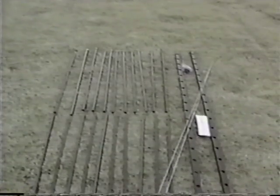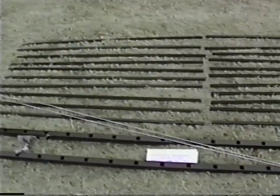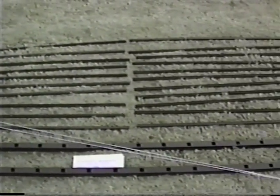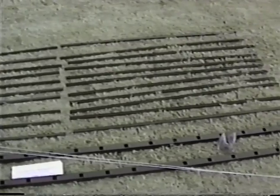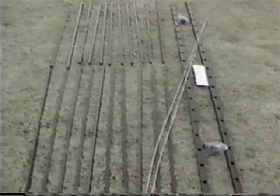At time of assembly and installation, the simplicity of the Aegis system becomes obvious. The contents of a box can be laid out so that rails, pickets, and other accessories are readily available to the assembler. Each box will contain either two or three rails depending upon the panel design, 21 pickets, a retaining rod, and a bag of 22 grommets for each rail.